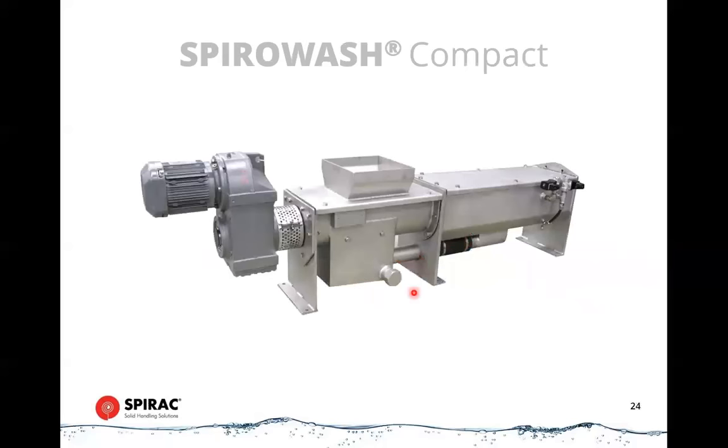And we call this one in particular a compact unit because it's got a very small wash box, rinse box on the bottom or drain box. So incoming screenings come in here. The initial water that's with the screenings will drain out through this box, and then the screenings will travel along, we inject more clean water in with the screenings into the press zone, and it'll discharge out the end. This is suitable for screenings applications where you're using a conveyor to feed the screenings in, so it doesn't have a lot of loose water.